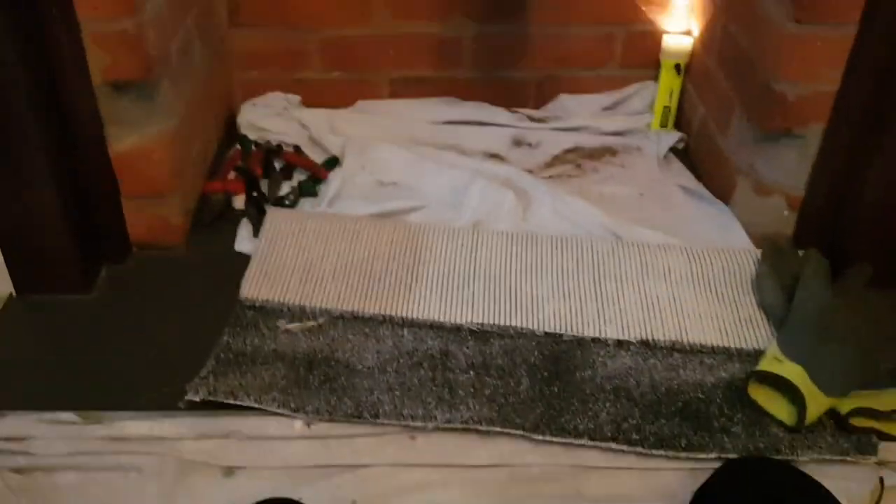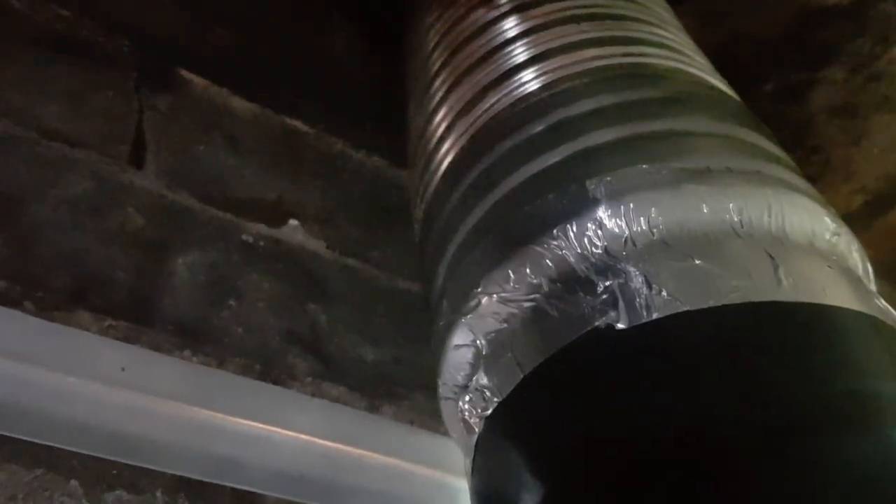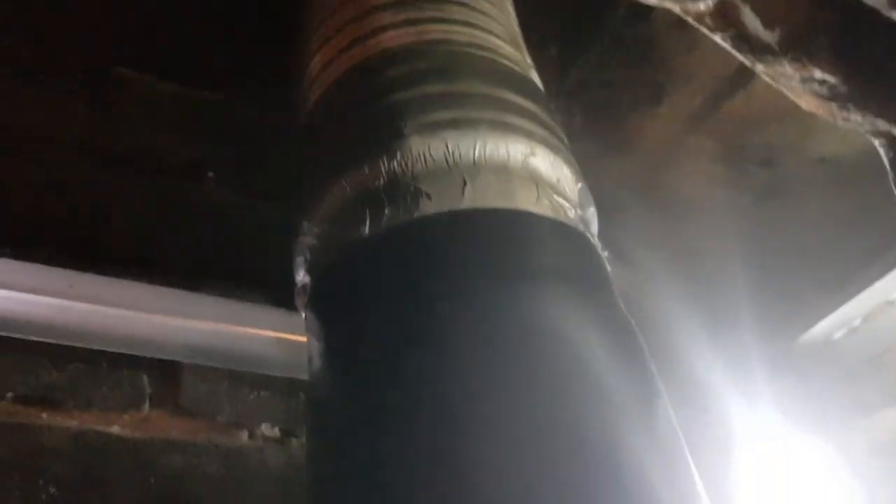There's been a little delay in putting it all in because I've re-tiled the hearth — it looks a bit better than just concrete. I've screwed the connector on quite well, but I'm going to unscrew it and put some tape in there — fireproof rope tape and some fire putty — and then screw it back on tight again. So that seals the pipe, but it'll be undone as yet. This black pipe will get cut down in line with that mark on the wall, and that should be the height of my little fireplace.